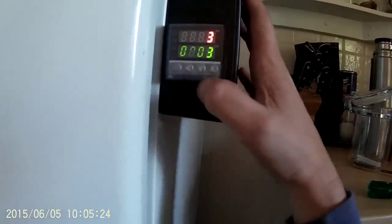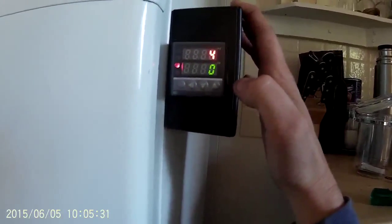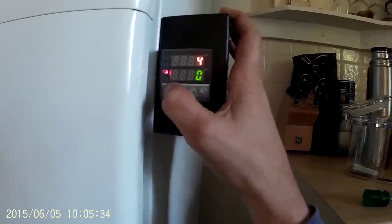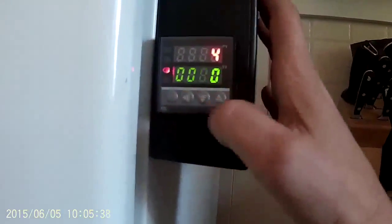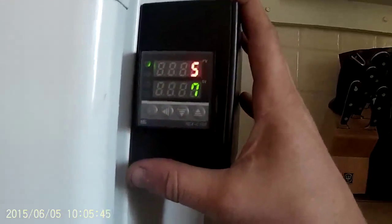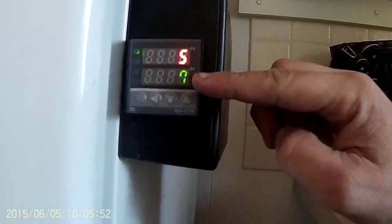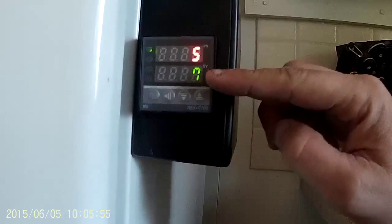I can show you now how you set it. Press the set button — I'll get the compressor to turn on by setting it down to 0 degrees. There you go, the compressor just came on. Now I'll turn off the compressor by setting it up to about 7 degrees — and off we go. That shows the current value and that shows the set value. In the back of the fridge you can see the thermocouple — we've run it into a little container of water, which just helps buffer it and stops the fridge turning on and off when you open it. Yeah, been really highly effective. Cheers guys.